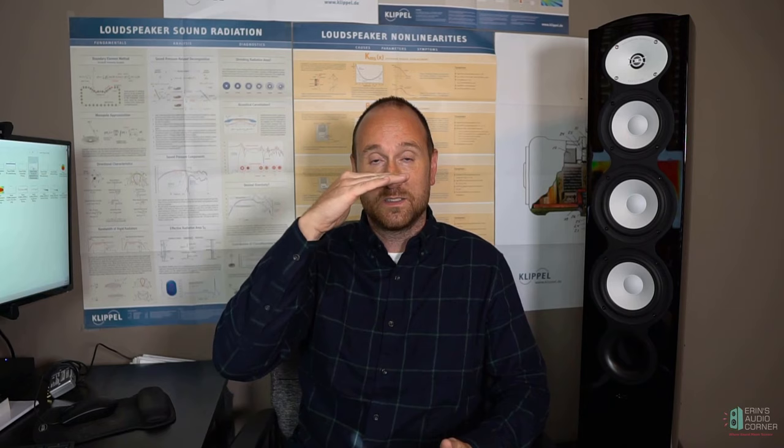That's again another great thing about this speaker. So that also means that you don't have to be sitting dead on axis with the tweeter. Your ears can be a little bit lower or a little bit above the speaker, and you're still going to get basically the same response that you would get on axis. And the same thing goes as it did for the side reflections in the vertical case. However, in this case, it would be the floor and the ceiling. So the things that are hitting the floor and the ceiling are coming back to you, and they're basically the same thing that you're going to hear in the seated position while you're listening to the direct sound. What this means is there will be very little coloration contributed by the floor and or the ceiling. This all really depends on your specific listening room, but by these guidances, what I'm seeing here is a very excellent speaker objectively.